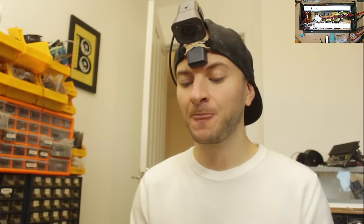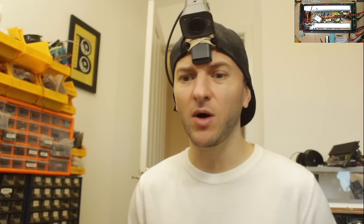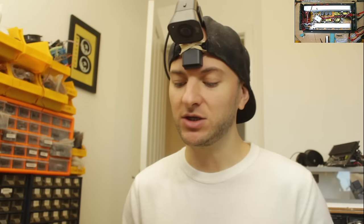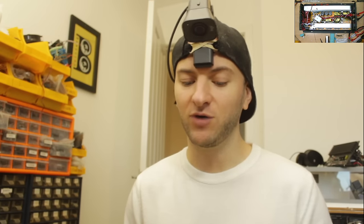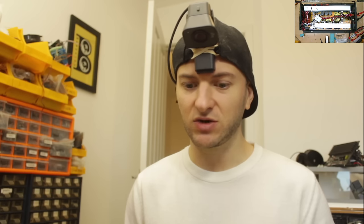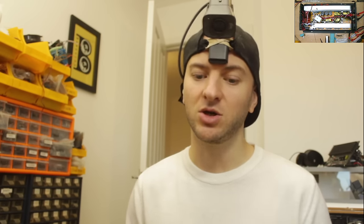It's probably killed the drivers again, so we're probably going to need more drivers. And more importantly, we need to work out why this was happy on a low rail voltage, creating a beautiful sine wave, but then as soon as it had the full rail present, it had this strange issue. And unfortunately, I wasn't probing both of the outputs, I was only probing one of them. So I don't know if there was some glitch or the other one was failing to build.